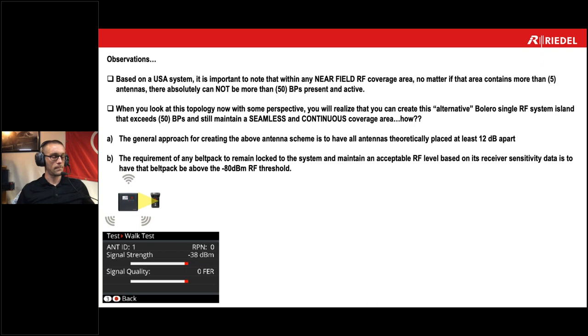So this goes back to a question from John Arenas. If you put three antennas right next to each other or really close together, do you have to do something special to prevent overloading the antennas, or do they overload at all? Really, the recommendation is 3 foot separation, and obviously don't point the antennas directly at each other. Although they're omnidirectional, as Jeff alluded to earlier, the rear lobe of that EMAG plot for the antenna's radiation is pretty low. So basically stack them with the bottoms facing the top. Yeah, you can put them back to back to back, almost like a cell tower. Oh, okay. Just don't point them directly at each other.